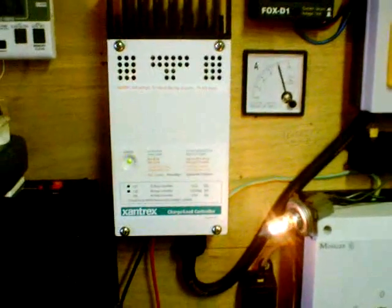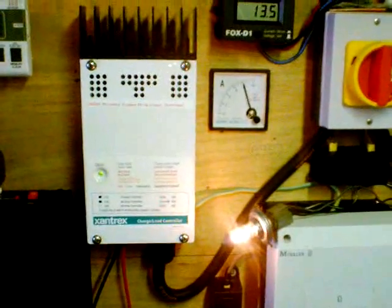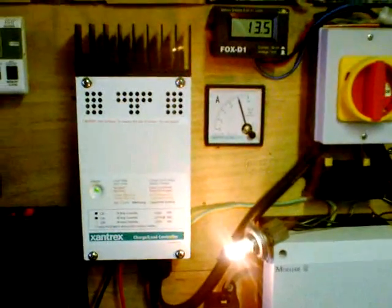I wish I could get my other meter now — the next update I'll update to this meter up here. I've actually got a 30 amp meter sitting up there for once I get 4 panels. That's 32 amps, and the charge is on as well — the load is on there again, so we're now overcharging the batteries and that's dumping the load. I've got a digital panel coming for the charge controller and that'll actually tell me what sort of kilowatt amp hours I'm producing, so I'll have some actual figures later on.